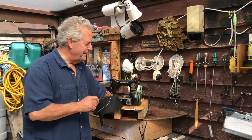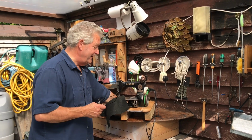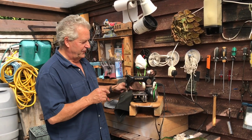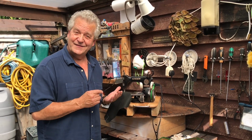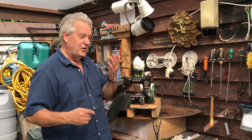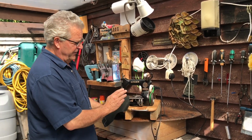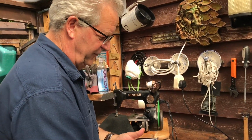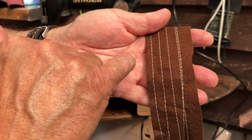2456 was one of the mainstay machines for the hat industry, but it was used for anything where you wanted a lovely narrow free arm, and it was a sort of a flatbed and a free arm all in one. Of course this does the basic chain stitch used in the caps and everything, and let me just show you it in action. The machine will do from 4 to 12 stitches per inch, so it will do a very large stitch down to a quite small stitch.